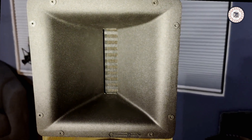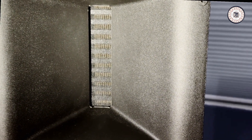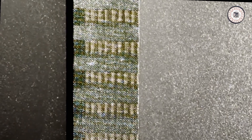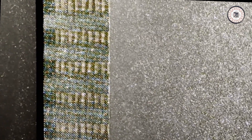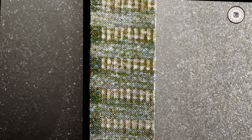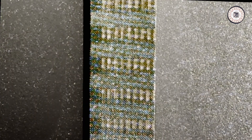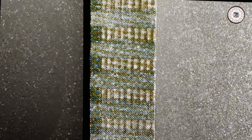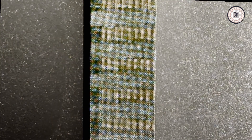Let's take a closer look at the diaphragm itself. You'll notice that the diaphragm is pleated. Those pleats move back and forth, creating an amplification of sound speed. When they squeeze together, the sound is accelerated about five times its normal speed. In a way, it's like a compression driver that uses pleats folding together based on very, very strong magnets on either side. The BEMA air motion transformer also has a horn attached to it.